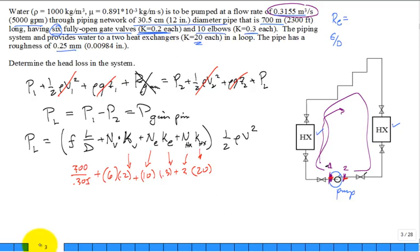So how do I calculate the Reynolds number? Yeah, it's rho, velocity, diameter over the viscosity. Glad they gave me the fluid properties in the problem statement. So that's covered. I just need the velocity. To get the velocity, that's not too hard. The velocity is equal to the volumetric flow rate divided by the cross-sectional area of the pipe. They give me the volumetric flow rate and the area of the pipe based on the diameter. It's doable, true? So let me see if I can pull up my numbers here. Maybe I can't.